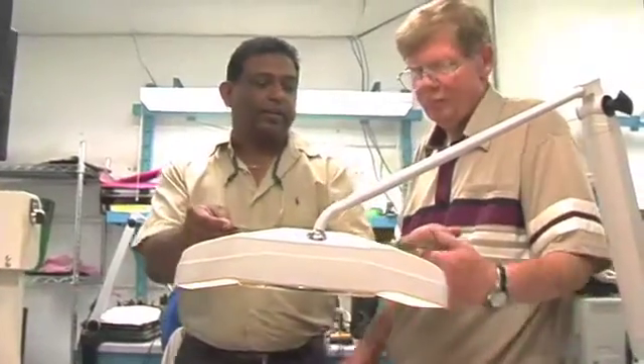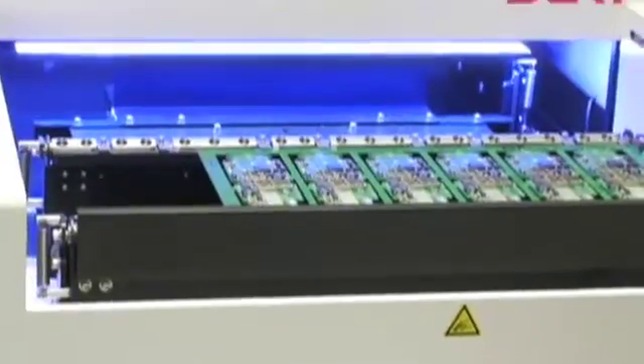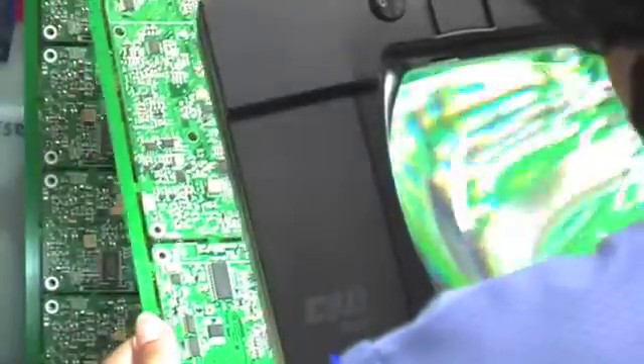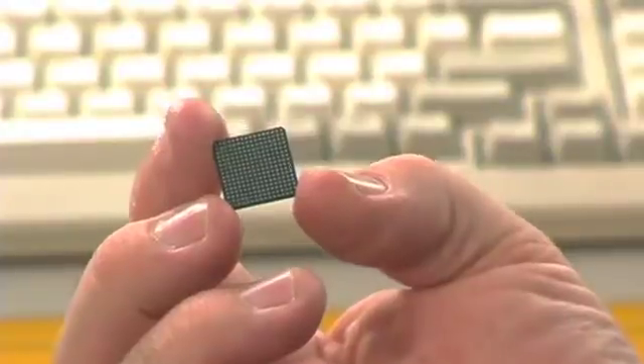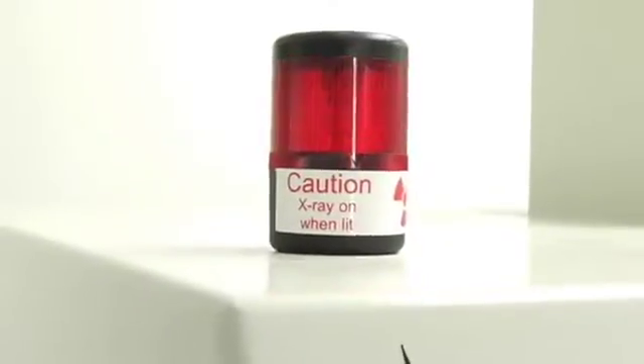As we come out of the SMT machine, we go into an optical inspection station that checks the soldered part against a blueprint, making sure that all the right components are on the board, on every board, and that they're in the right place. Some components are extremely small, or the solder points — the ball grid array — are on the back side or buried in a way that we can't visually inspect. From ACR's point of view, we have to be able to ensure that those solder points are all perfect, so we have a PCB x-ray analyzer.